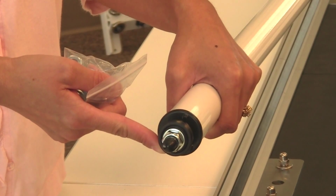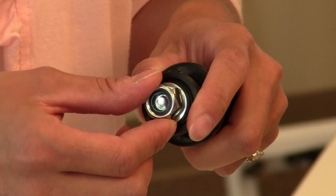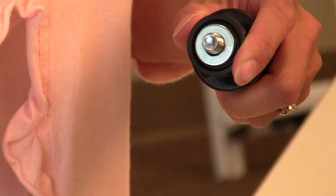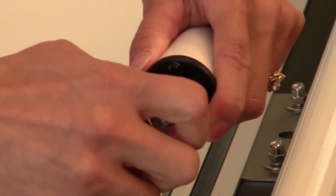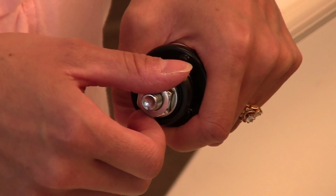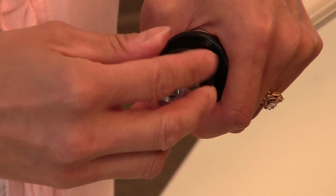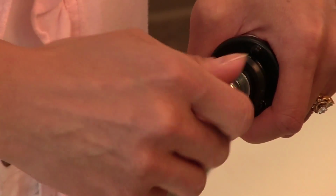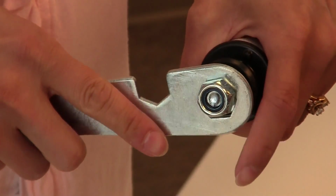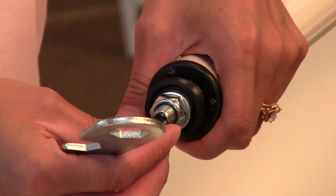If you have difficulty holding the pole end while tightening it, a regular nut is included as an assembly aid tool for tightening the pole end more quickly and easily. Remove the lock nut and put on the regular nut tool. Tighten it fully until 3/8 inch of thread is sticking out. Now remove the nut tool and replace it with your lock nut. Repeat this process with all pole ends and insert your rubber caps.